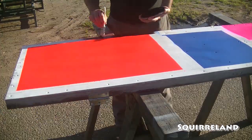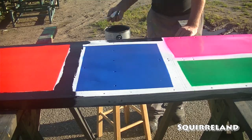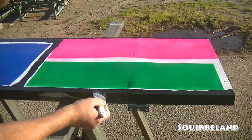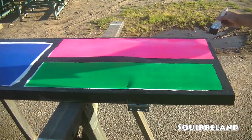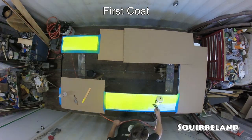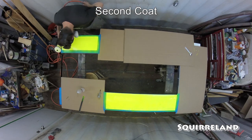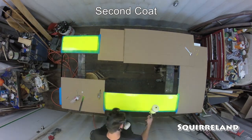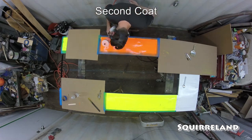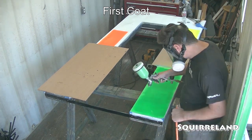With all the fluorescent paints fully dry on the door, I went ahead and painted the entire perimeter as well as the spaces between the packing crates with a heavy coat of semi-gloss black paint. Now that I have all of the basic paint finished on the front of the door, I can move on to painting the framed panel. The fluorescent paints I'm using are called Wildfire by Modern Masters — I'm not sponsored, it's just what I'm using. These fluorescent paints are very transparent, especially yellow and green, so every shape gets two solid coats to make sure the color is even and doesn't look blotchy.